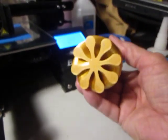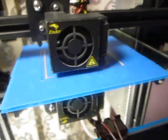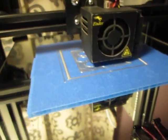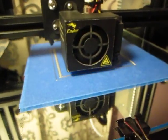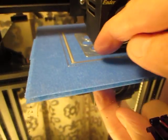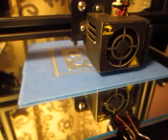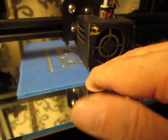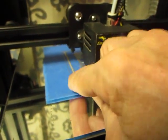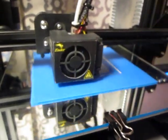I did the first half with no issues — you can see that's the bottom of it, pretty smooth. This is going to be the second part, where this will fit inside this piece. You can see there are no visible lines. The first layer should always be very smooth and replicate the surface area it's printed on. In this case, it's number 2090 tape, and the bottom of this replicated the surface of the tape perfectly. That's a perfect first layer.